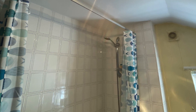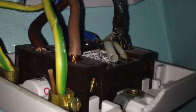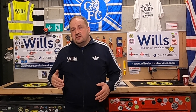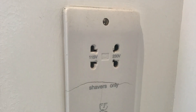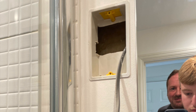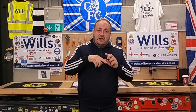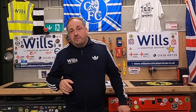Check that you can't physically touch the main light fitting from the bath or shower cubicle. Any equipment in there has to have the relevant isolator — a fan isolator, shower isolator. Make sure the light switch is either a pull cord or located outside the room. For shaver points, we've had a couple where someone was too lazy to put a double back box in a dry lining box, so they cut the back of it out — you've got to look for that.